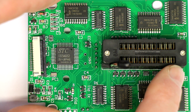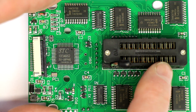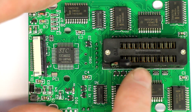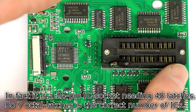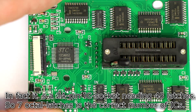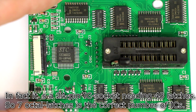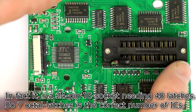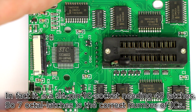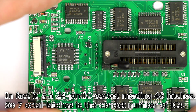And we have a 20-pin IC test socket. So this fits the numbers that you need for 20 pins to give them either a high or low or a tri-state. These octal latches can also go into tri-state mode, and so you need at least 40 outputs, and therefore, well, then 5 of them would suffice. So there must be some additional function.